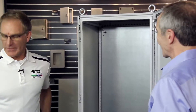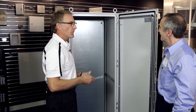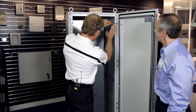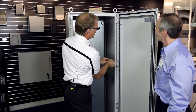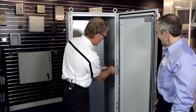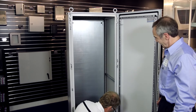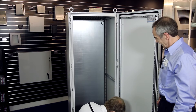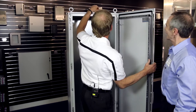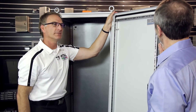That's our opening mechanism. To take the door off, we really just need a flat blade screwdriver. What I like to do is wedge into a gap and start to pry the hinge pins down. I leave the top one on so it takes the weight, so I can work my way down and not have to worry about the door. And there's the door off — pretty quick, pretty simple. One-person job.